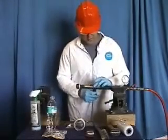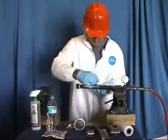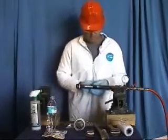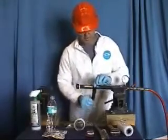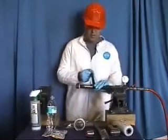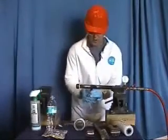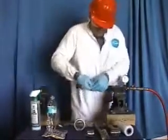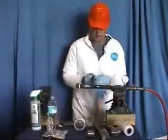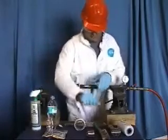Place the pressure sealing tape just outside of the repair area. The start of the pressure sealing tape has an adhesive bond. We're going to place that over the repair site. Hold the max tension and go directly over the repair. Work quickly. Focus the materials directly over the repair hole at max tension.